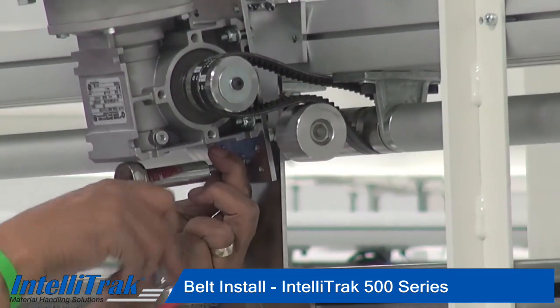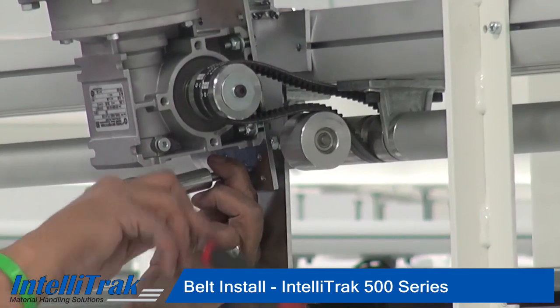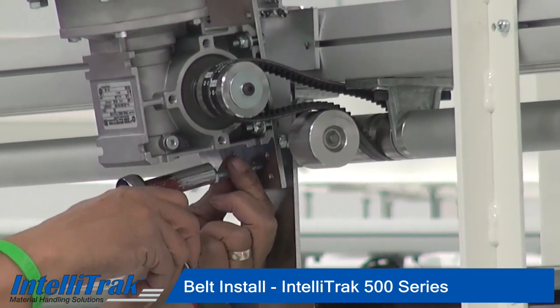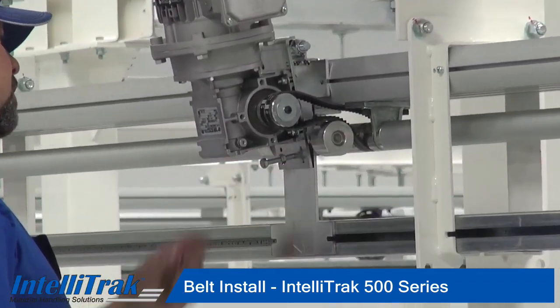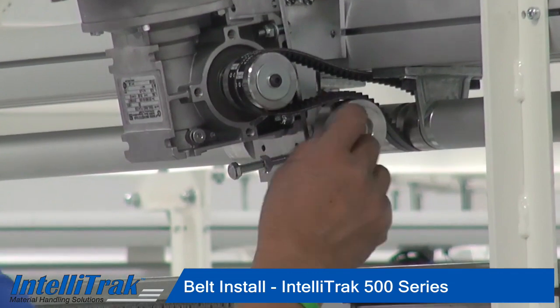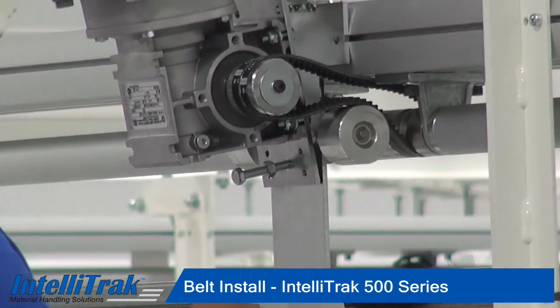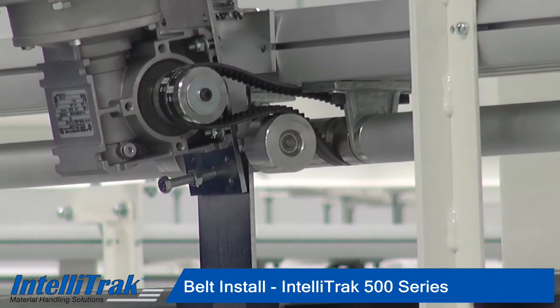Now you have all 4 belts installed. And at this time you can do a visual lineup to make sure that the belt spacing is the same on this side as it is on this side. And the belts should be somewhat centered on the idler pulley. Once they look good, then you can tighten your jack screw.